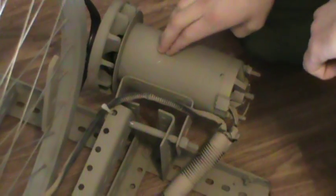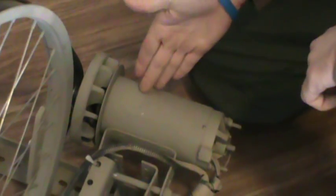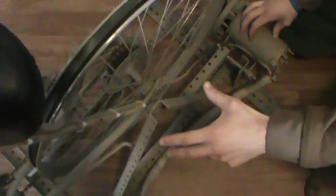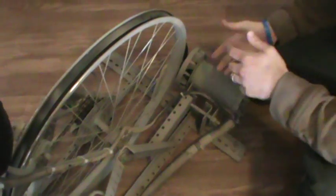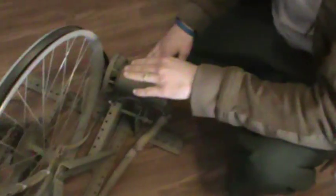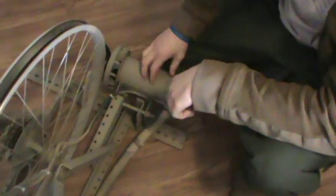Make sure that you have a DC powered treadmill motor, because you've got to remember that this motor used to move a human being, and it took a lot of power to do that. Now a human being is moving it, geared through a bicycle — that's your transmission — so you're making a lot of power back out. You don't want an alternator at all. If you watch other videos on YouTube using an alternator, you see those people about to stroke out trying to get it done. Do not go that route. You want something comfortable for everyone to use.